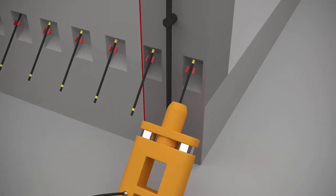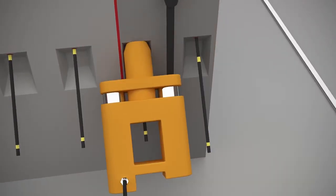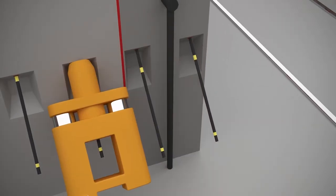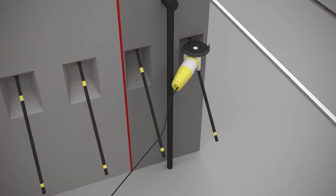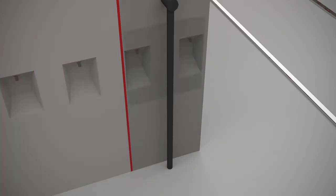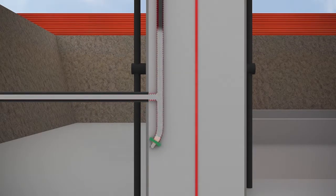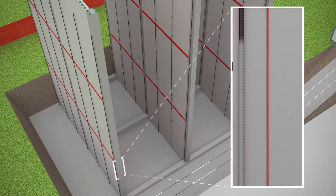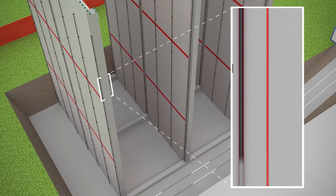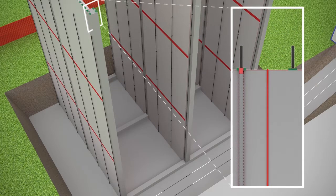After the printer is dismantled and the concrete sets, it is tested for compressive stress. To do this, anchors are attached to the ends of the cables that span the concrete slabs. The cables are then tensioned with hydraulic jacks. In order to solidify the bond between the concrete, anchors, and cable, either cement paste or solution under pressure is injected into the channel. The injection is conducted through the tees inserted during the manufacturing process.